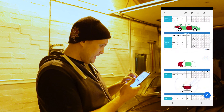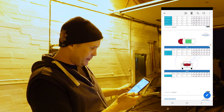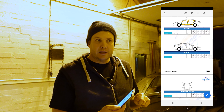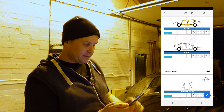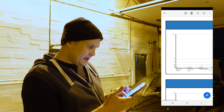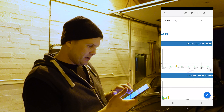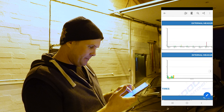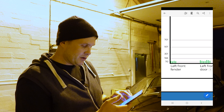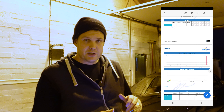On the roof, bonnet, and boot lid, you have all your readings, plus the internal measurements as well. If you went through the inside of the bonnet, boot, and door frames, you'd have even more measurements here. The charts section gives you a visual graph of where the medians are and where the green lines are at for depth across the car — an easier visual way to see the overall average, showing both external and internal measurements.